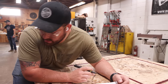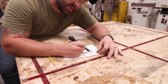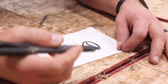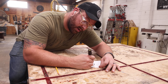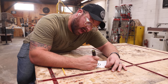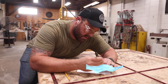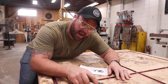The concept here is I want to have a round top — this is going to look similar to the lava table if you guys remember — and then I want the base to kind of slowly twirl down. In order to do this I think it all needs to be end grain. I'll stack a bunch of pieces that follow the curve's path and then carve it. The top I'll do the same, making random-length pieces to look wavy, which means making a segmented ring.